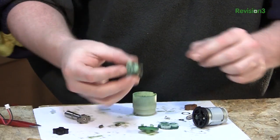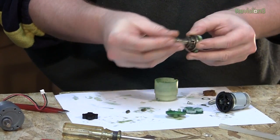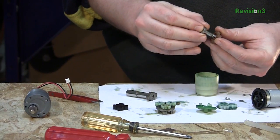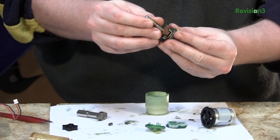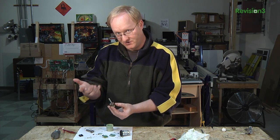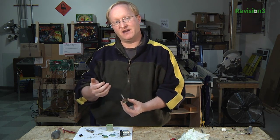There are two stages in succession on this one. Originally the bit would fit right here, but I want to replace that with this adapter I made that will fit in and lock using its hex head. Then we can cut grooves into this bolt with a Dremel and make it a hobbed bolt — what 3D printer makers call it. We'll actually use these threads to make our gripping surface and see if we can use that to drive the glue stick.